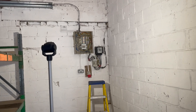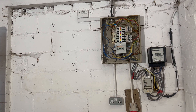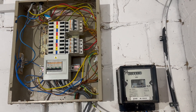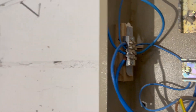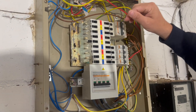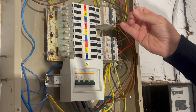The only real things we have to bond in here is probably the structural steel - there's no water, no gas, it's literally in the middle of nowhere. I'm not too sure whether he needs three-phase or single phase because there's quite a difference in price. We'll probably put a main switch with 100 milliamps with RCDs. That's as rough as you can get. And look at that - see that condensation? Is it damp? No, it's more like sap or some kind of oil.